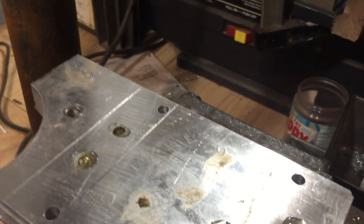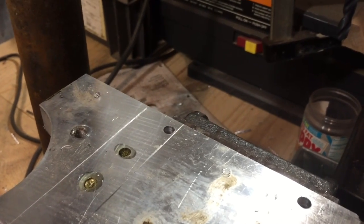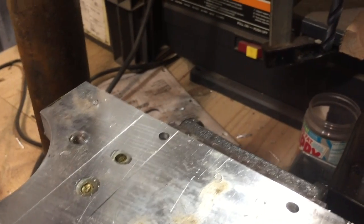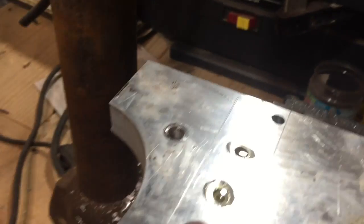The spindle I have has six millimeter versus quarter inch bolts, so they're six millimeter with a thread. I'm using a five millimeter bit so I can thread these four holes. And what I've done is just lay them out with the CNC.